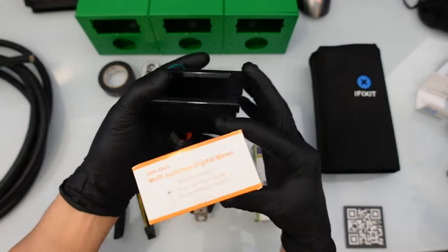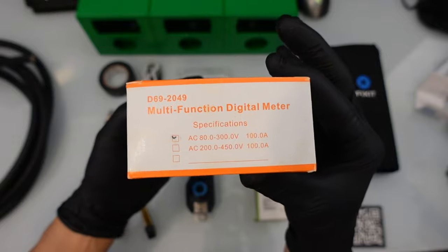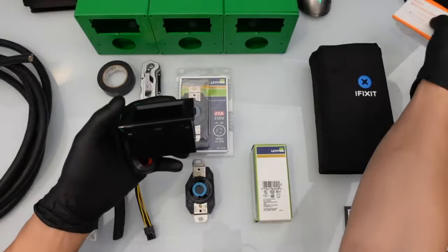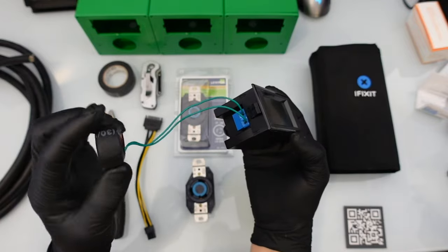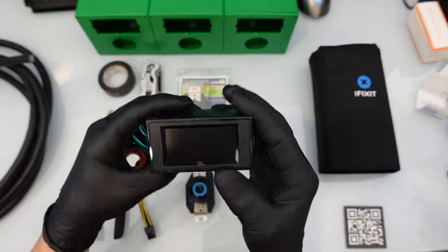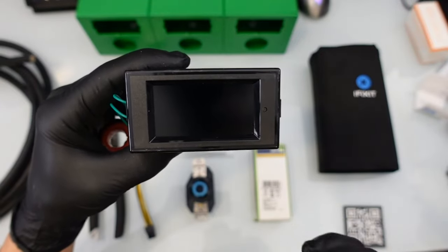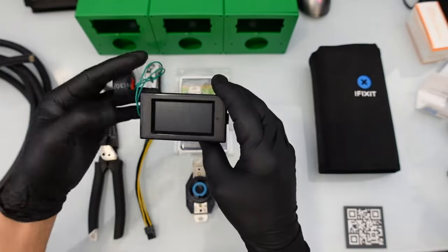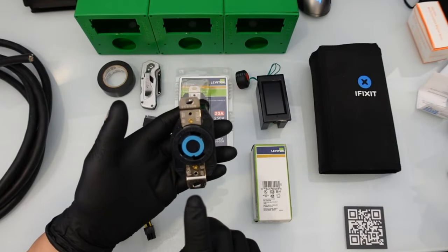This is obviously the entire reason you want to set up your own meter box. It's got one green wire hanging off of it, and the box says AC 80–300V, so it's good for up to 300 volts — perfectly fine for 240. It also has this current reader, which is where one of the hot legs actually goes through. The little dot on the right-hand side of the screen means it should stay to the right so it always reads correctly and isn't upside down.